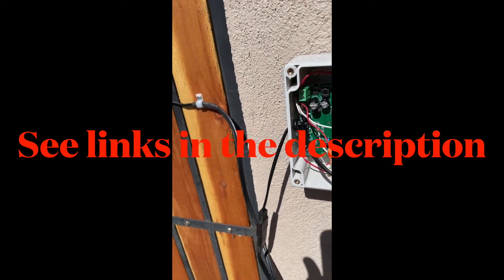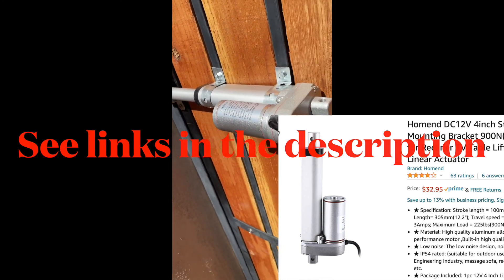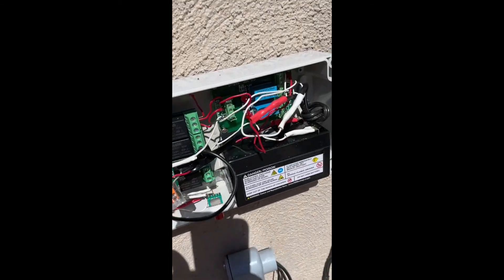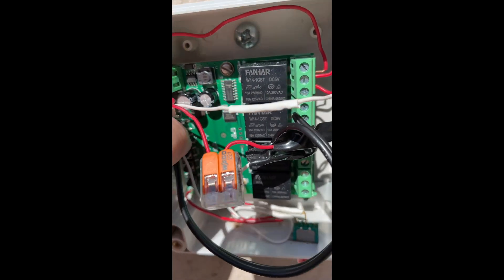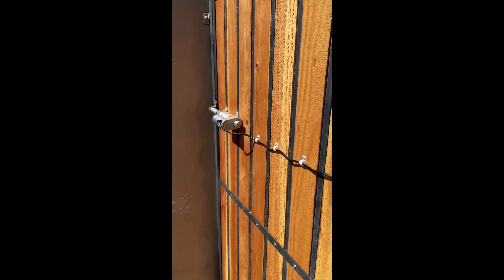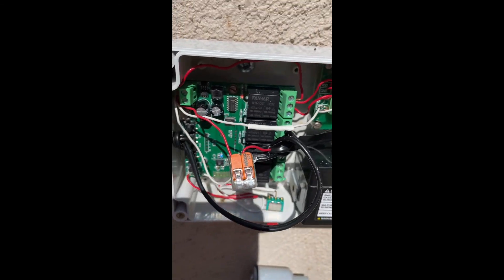It's all Alexa board, relay board, battery, and some fancy wiring. The thing to know is this actuator reverses direction just by reversing the 12-volt polarity. So that's all these relays are doing — reversing the plus and minus in one direction or the other. I can manually activate relay four by pressing the first button, or I can use the switch, or I can tell Alexa.